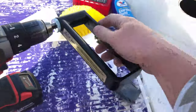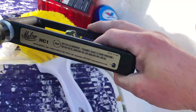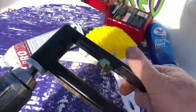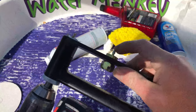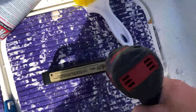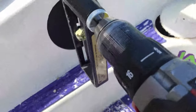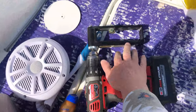This is a Malco HC1 — just type in 'Malco hole cutter.' Basically what it is: you drill one hole first, make a center hole, then you put this in the center hole and just spin and rotate around that center point. With this cutting bit on the end, it'll make a perfect hole. That's how I made this hole right here, and that's also how I made the same hole inside the steering column.